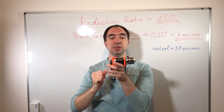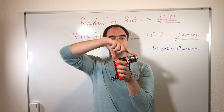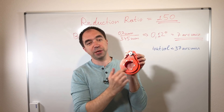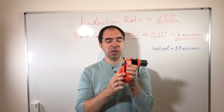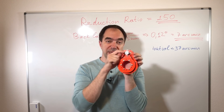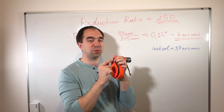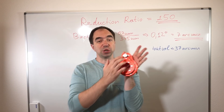Today we built this actuator — a brushless motor with a planetary gearbox, which is the assembly from one of my previous videos. To this assembly we added an additional stage with a belt and a slew bearing, giving a total reduction of 150: a reduction ratio of 30 in the planetary gearbox and a reduction ratio of 5 in the belt. This is a GT3 belt, which has almost zero backlash. The idea was that thanks to this additional stage we reduce the backlash — because there is backlash in the planetary gearbox, and after the additional reduction stage it should be reduced. We estimated the backlash at around 7 arc minutes, compared to 37 arc minutes from the gearbox itself — basically five times smaller, which is comparable with the reduction ratio of the final stage.